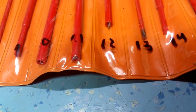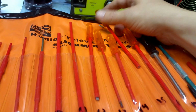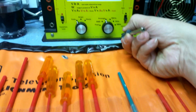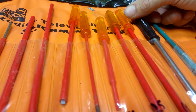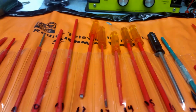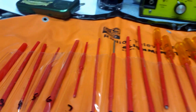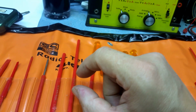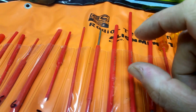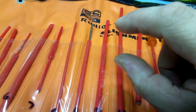This one I think has actually been modified as a plastic flat-ended screwdriver. The other type with a screwdriver handle on, you can see there with the metal shaft, so that's useful. We've even got some of the different adjustments for the more European style connectors, trimmers, and the typical one that you'll come across probably is what they call the beehive, the Philips beehive, which is a variable capacitor, and it looks like I haven't actually got one easily available. It looks like an old-fashioned beehive, not the square type but the round type, like the type that Winnie the Pooh used to go and raid, put his hand in.